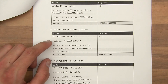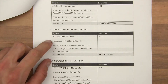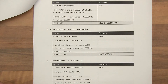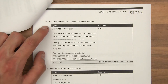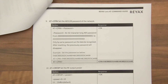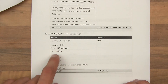All you do is connect to it via one of these — a USB to TTL converter — and you send over these commands. AT plus address equals 0, AT plus address equals 1 to the other one. And the network ID defaults to 0 anyway. Considering I've only got two and they're on the same network, 0 works fine for me. CPIN I didn't bother with — it's an AES128 password. You can password protect your communication, which is really good. Then we've got RF power — we can mess about with the power. The default is 15 dBm.